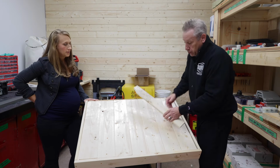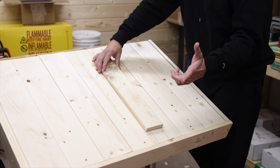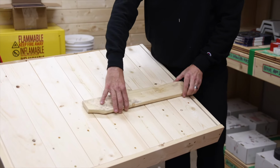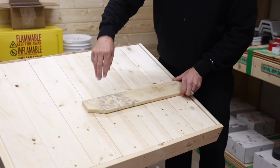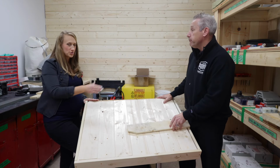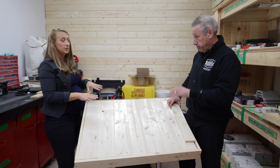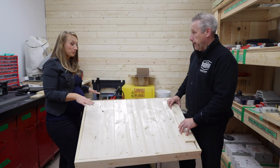Okay. So if you have them only running this way, you have to really plan where the sheet hits it to get the strap, but you're not going to find that, I promise. By going lateral on the upper level, then you're able to make sure that you always can find the strap with the sheet. Yeah, that's a good point. Always make sure you're running horizontally for that upper, final layer. Correct, whatever's going right before your metal roof.